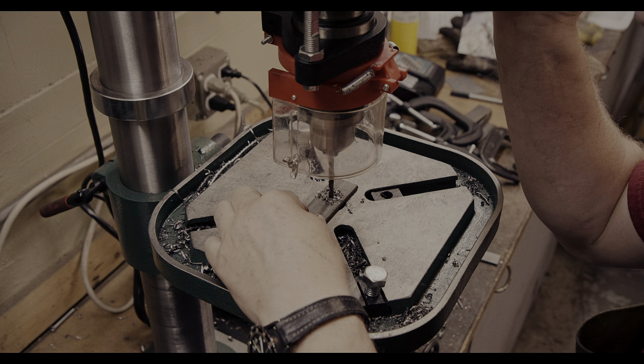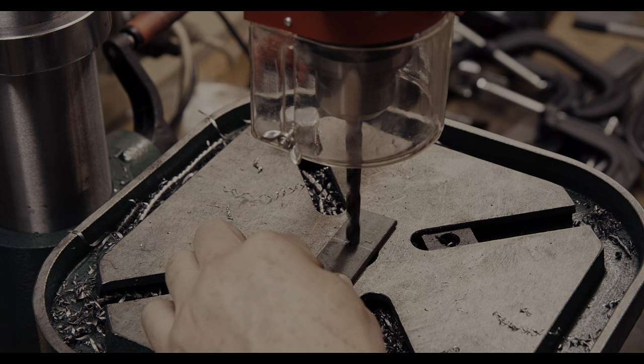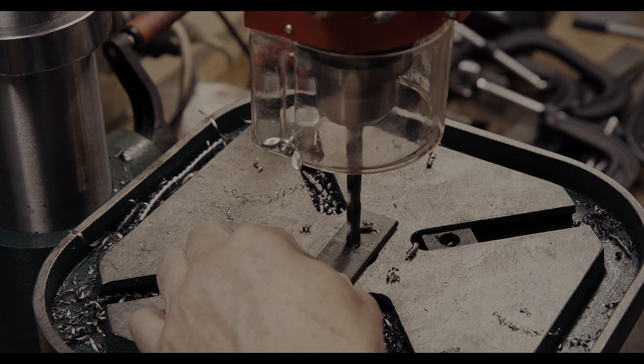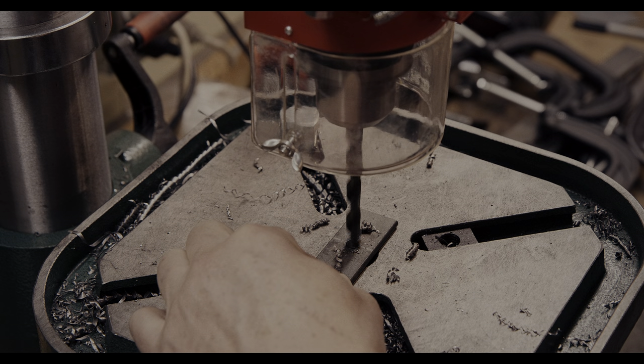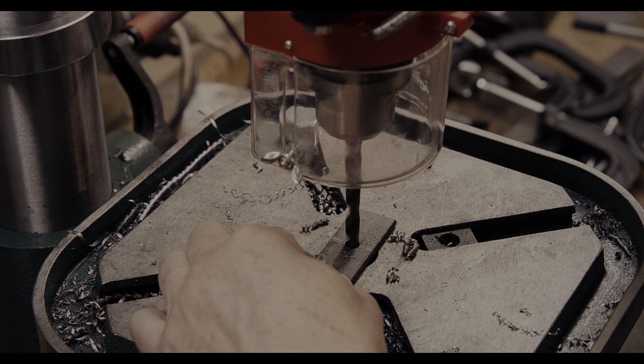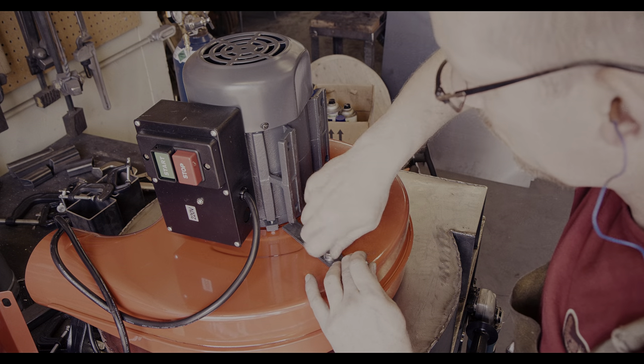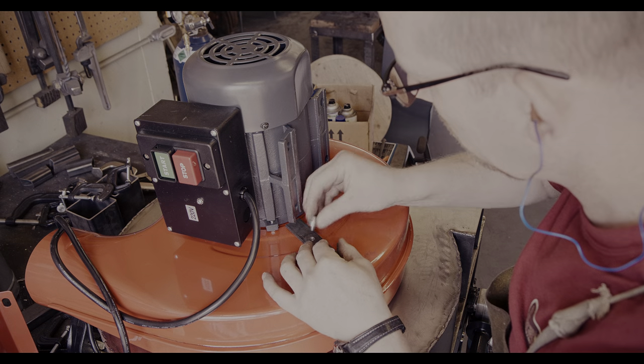The blower is not really designed to run in this particular orientation, so it will be interesting to see if the impeller comes loose more easily when compared to operating it upright. For my other blowers, I definitely had to adjust the impeller using various set screws to prevent it from scraping the housing over the years.